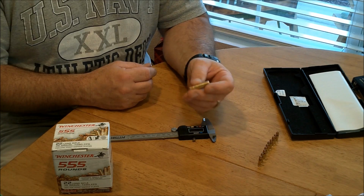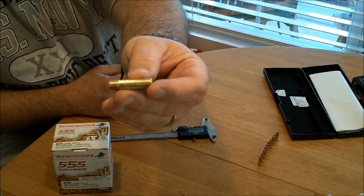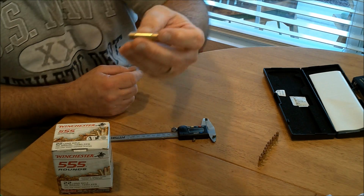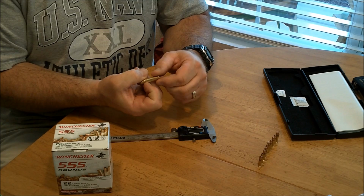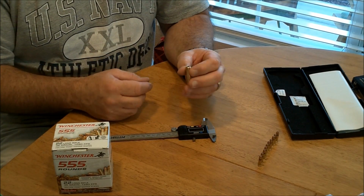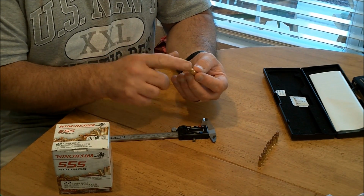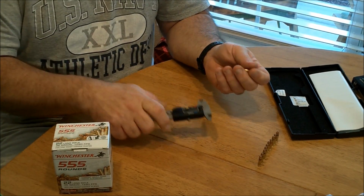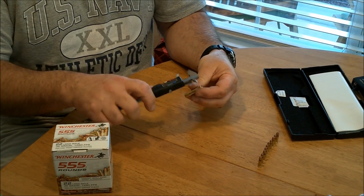Getting it from Home Depot, I measured it, and if you notice, on one side of it here by my thumb, that particular side has a ridge cut into it. Right here, you can actually feel it with your fingernail. It's got a ridge cut into it. Just to make sure that I measure from the same side every time, I'm going to measure from that side. So I'm going to set up my calipers. I'm going to turn it on. It automatically pretty much zeroes out.